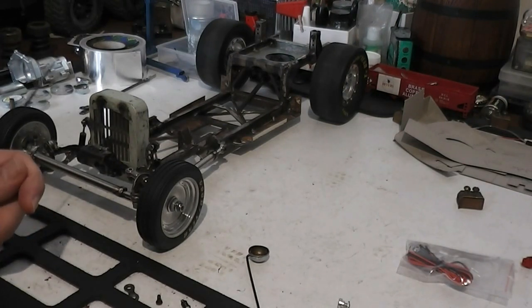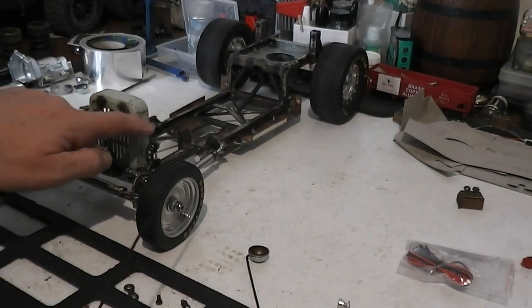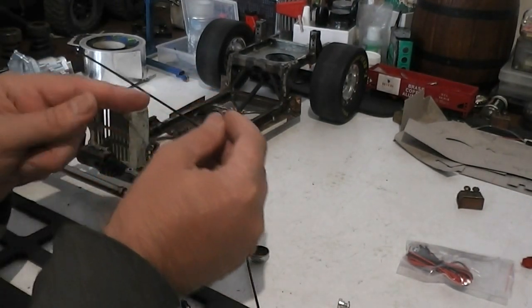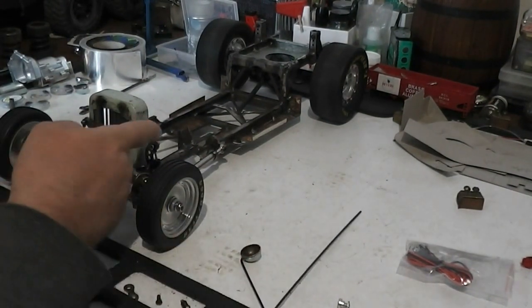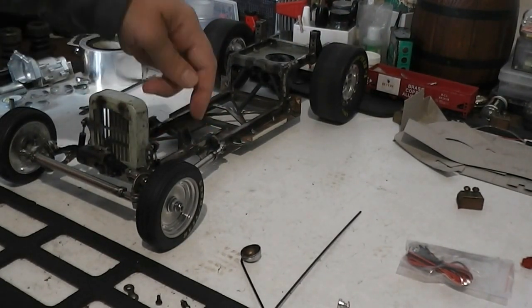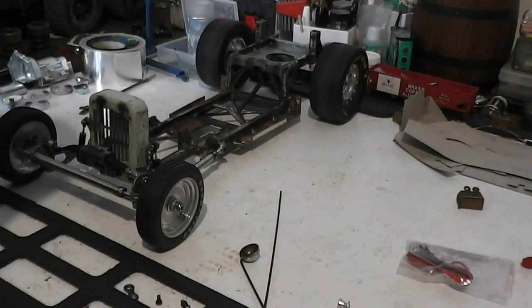Then I'll probably even make a backing plate to go in the back behind this rear light tin, so there's a bit more meat to take the weld here. I'll cut these shorter but still too long, and when I tack them, this stuff usually just disappears on you, and you don't have to cut it, it just burns out, but it will leave enough meat. So I'll probably do that, put a strip of normal sheet metal on the inside and plug weld it in. Tack those on and we'll be done. I'm not going to mount the LEDs and do the wiring at this stage of the build, that can come later. So yeah, let's get out to the workshop.